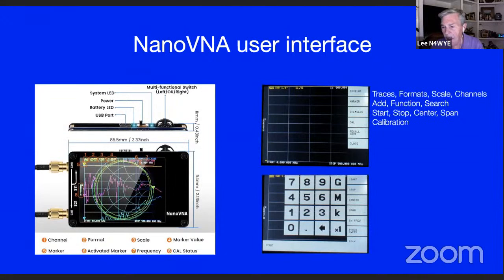Then there's a calibration mechanism. You've probably heard bad things about the calibration one, but don't let that scare you, because all they're trying to do is to take out all of the variables and make sure that the readings that you get are accurate. I haven't calibrated mine in probably 6 months. I just use it like it is, because I'm using 50 kilohertz to 30 megahertz. And so I've calibrated it for that frequency band, and I haven't noticed any problems with the accuracy at all. And I've done the calibration over again, and it's dead on. So I haven't worried about it.